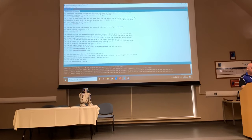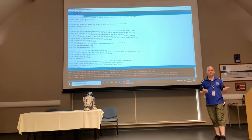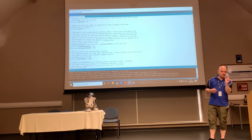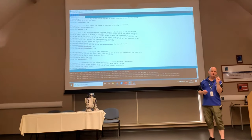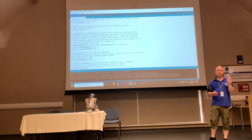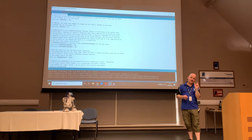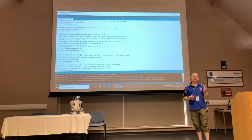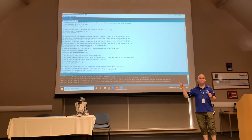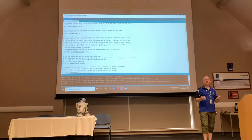The next thing it talks about is something called deadband. Any kind of controller, be it a traditional remote control or the Xbox controllers, has a little bit of wiggle movement right in the middle, and that's what's known as deadband. What you want is for your droid to not be moving when the stick's in the middle. Sometimes if you give it a tiny bit of pressure, it might start moving. So you can increase the size of this dead band, or dead zone, and it just means you've got a little bit of leeway on that stick before the droid starts moving.